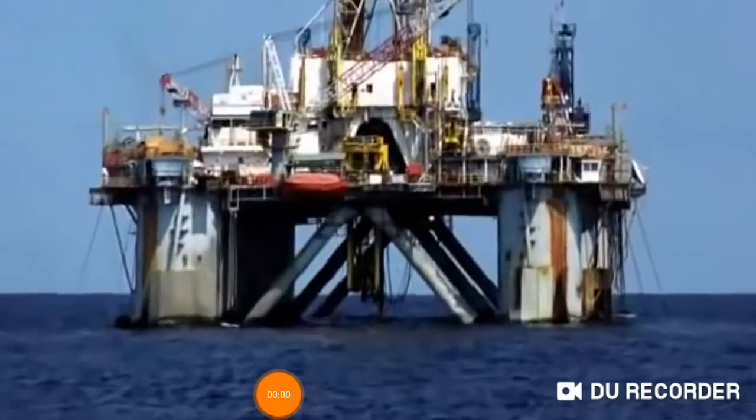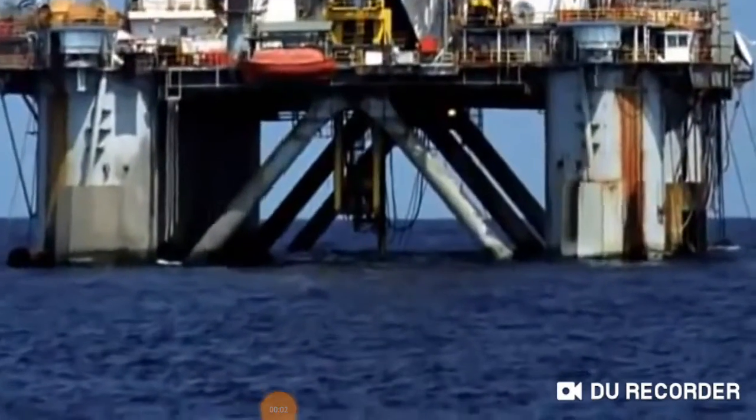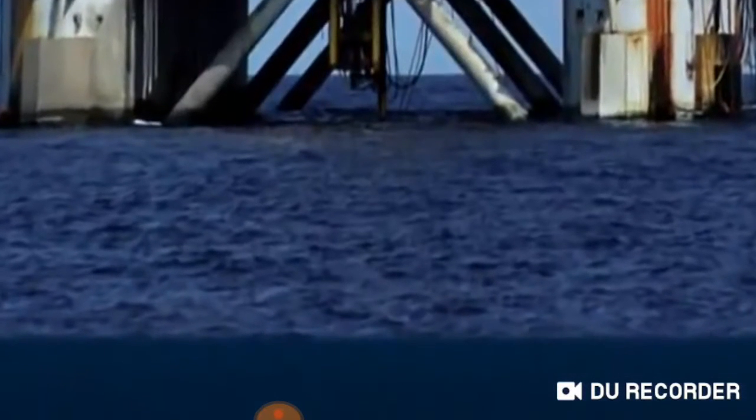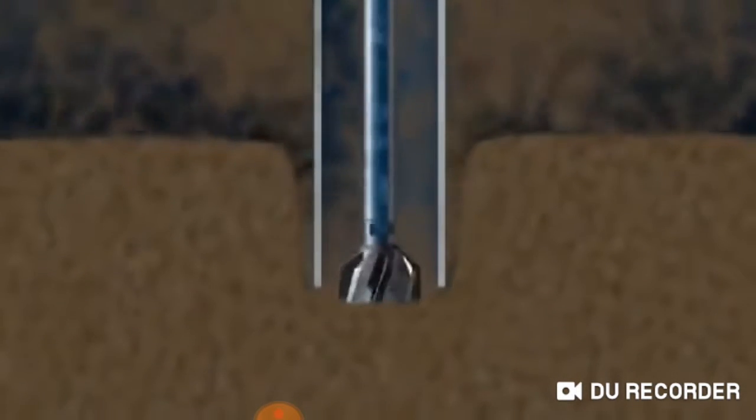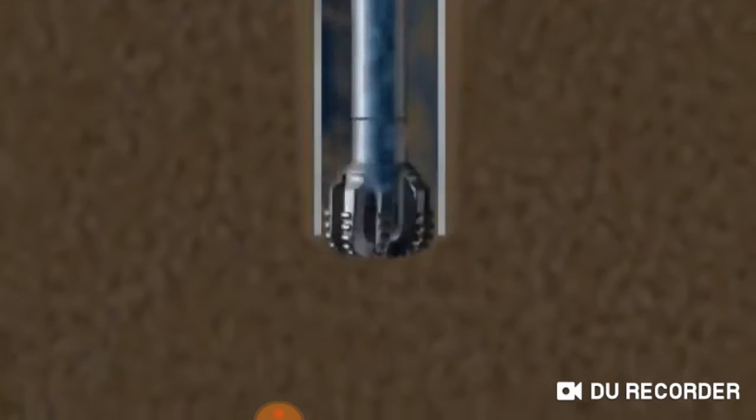Drilling rigs have all the functions of onshore rigs, but also need to stay on station in a variety of sea states and allow for secure connections between the surface and the sea floor. To start an offshore well, a thick-walled, large-diameter hollow tube called a conductor is embedded in the sea floor, with the aid of a bit that jets away the sediment with high-pressure seawater.